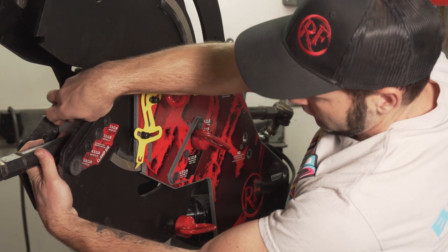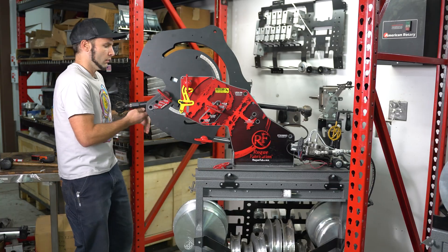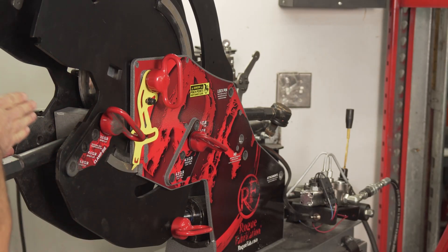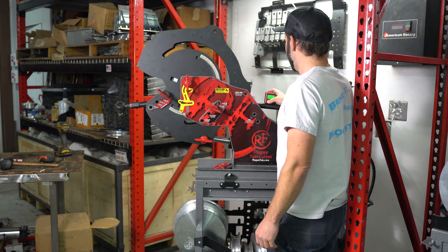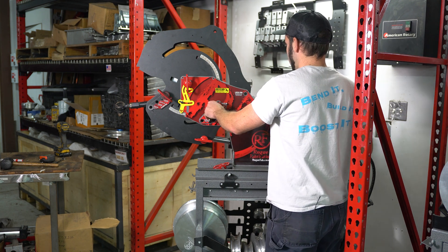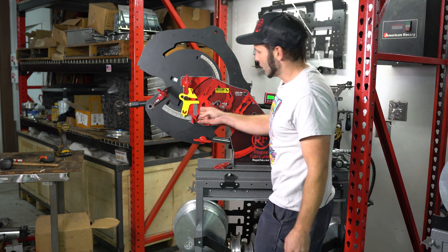The two and a half fits nice. I'm checking to make sure I can see our line, to make sure we don't have this rotated too much — it is farm equipment so we don't have to be perfect about it. Okay, that's tight. We're at a third of a degree here, and I'm going to zero this out as well.